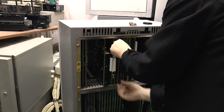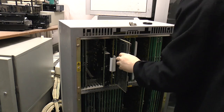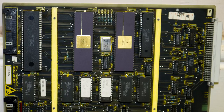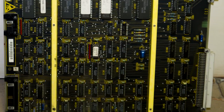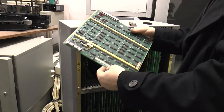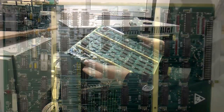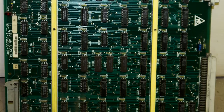We do see quite a few cards in here that don't belong where I'd expect to find them. This one is Delta CH Cont — seems it's a Delta channel controller. Nice big 68000 processor. And it's really showing its age here with this one: Dig SW Control — I assume it's a digital switch controller. There's a crystal and a trimmer there as well. It's all discrete logic, all 74LS series buffers.